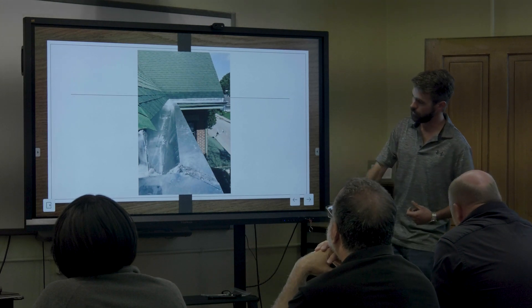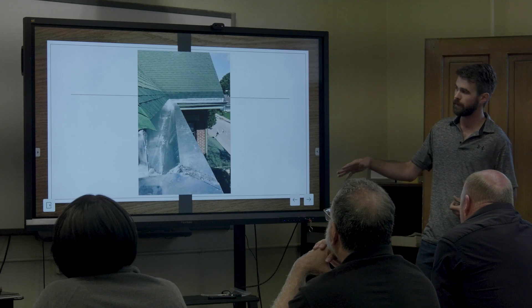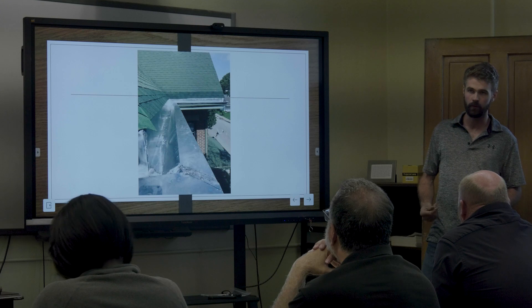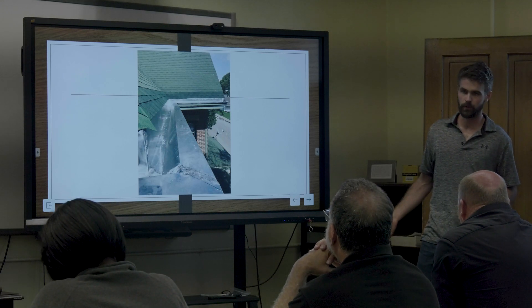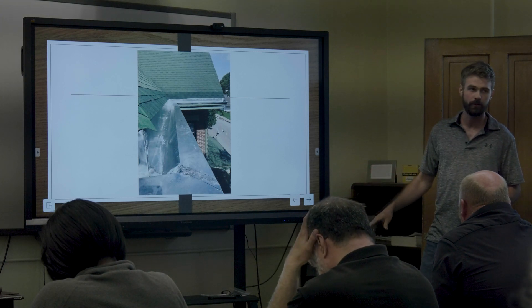Here's a picture of a steel liner — this is stainless steel. I'm not the biggest fan and usually don't do stainless steel because it's a little bit more difficult to solder. Labor-wise and material-wise, it's going to be more expensive. At that point, I would highly recommend just going with copper.